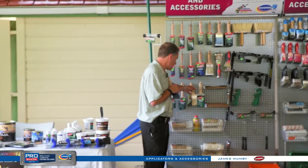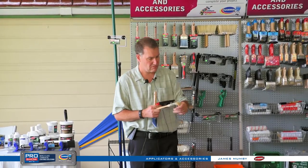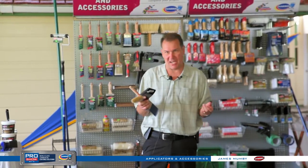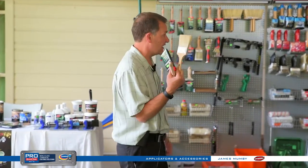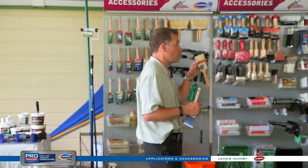We've also brought in a 100% bristle brush — our Aristocrat series. You may have noticed that black bristle in the market is now shiny because it's white bristle dyed black. It's getting very hard to get black bristle, so the hogs are blonde and then they dye the bristle. We're just going ahead and using the raw white bristle as is, instead of dyeing it — because that process changes the attributes of bristle anyway.